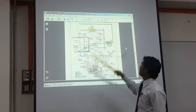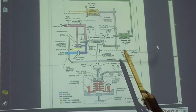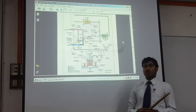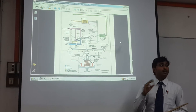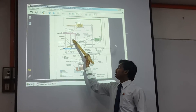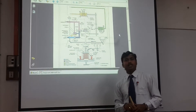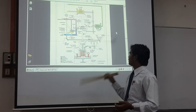As shown in the figure, the dotted lines represent the computing section, whereas the un-dotted lines represent the metering section. In the metering section, there is a metering valve which meters the fuel as per requirement and maintains a differential pressure between the unmetered and metered fuel, controlled by the differential bypass valve. In the computing section, there is a throttle valve and a flyweight mechanism which maintains speed and delivers fuel as per the RPM requirement.